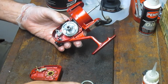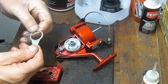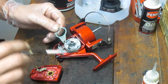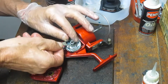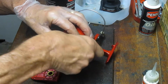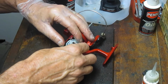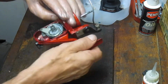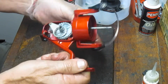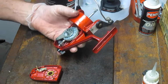Line it up. Crosswind arm. There's two sides, kind of a rounded shiny side and the dull side. The dull side is what's going to ride against the gear, so let's put a little bit of grease on that. Get that over the loop, and then let's match that to the stud here that it rides on. Just like that. Then we can give it a spin, make sure that it's traveling right. And there we go. It's doing what it should be doing.